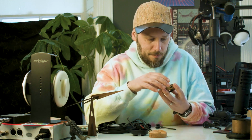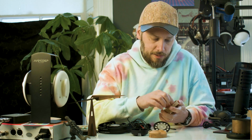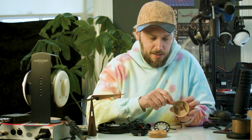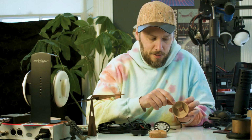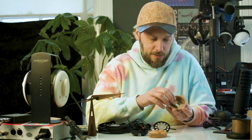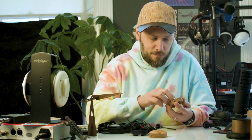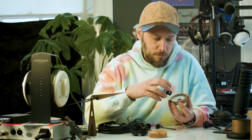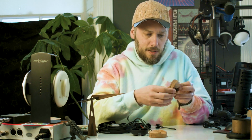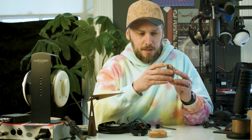And that's going to be very hard to make out of wood, especially when it's this thin. So what I would probably do if he was going to change the design of these slightly is I would probably shift this downwards. I'd either extend this bottom bit just a fraction. I think that's going to be the way to do it, because this is already quite thin and you don't want to break that. So I think I'd extend it by maybe 0.5 millimeter, just so that you've got plenty of room for the felt disc to go in without it causing issues in assembly. Because that's probably fine, but it annoys me that that's not fully clicked in, whereas without the felt disc it does click in nicely. So that's a better fit.